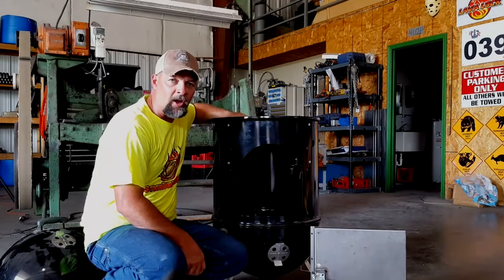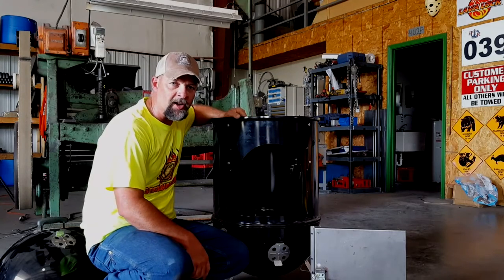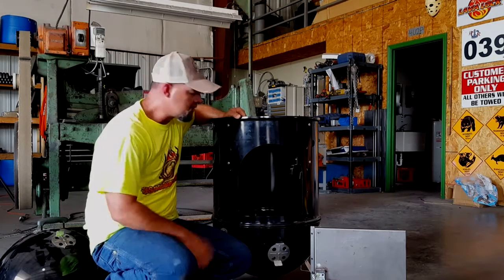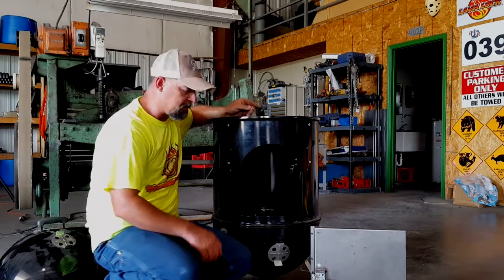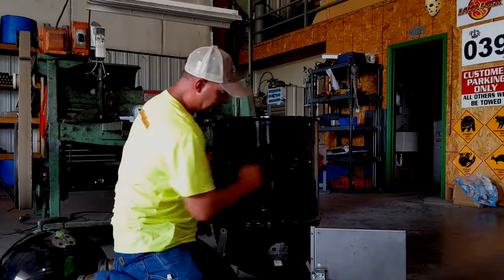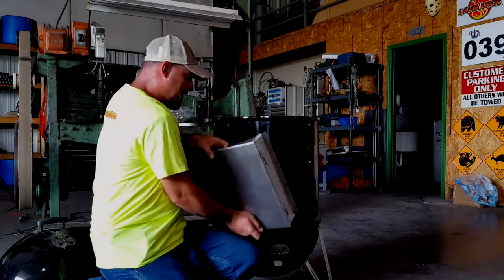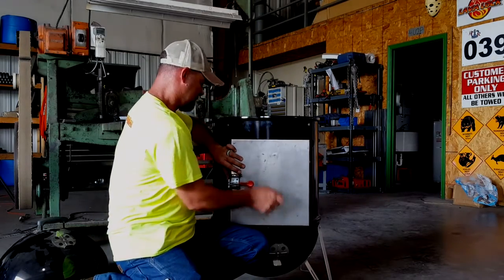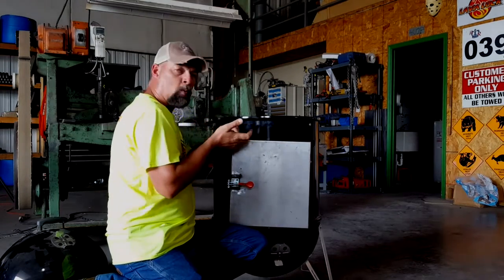These cookers are coated with a ceramic coating, so be patient with your drill bit. It's got to puncture through that ceramic coating on the outside before it drills through. It's always better to drill slow and put pressure on it. Maybe use a drilling lubricant of some kind to help you cut your threads without ruining your drill bit. Once you get all your holes drilled on both sides, get the top one lined up — you can kind of set it on your knee, but it also rests on that rib at the bottom.